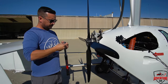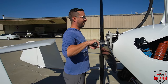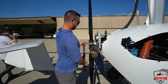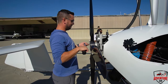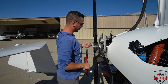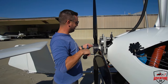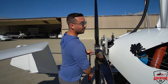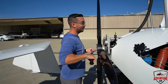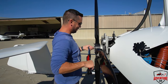On the Papa Golf when we did it, it was like a thin washer that made a difference on that hub. But it was the blue ELA that used to be here — that thing was so out of balance because the spinner cone had been repaired. There was a huge patch of fiberglass on one side, and it threw it off by one and a quarter inch per second. So it was moving 1.25 inches per second in space every time it was spinning. Once we got that dialed in, there was no rotor balance necessary because it wasn't the rotor — it was the propeller.